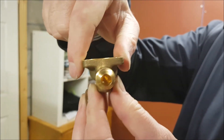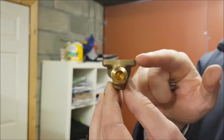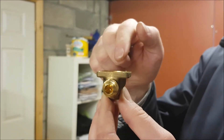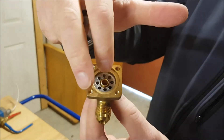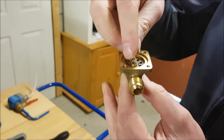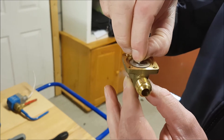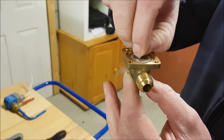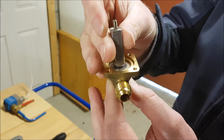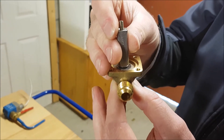If I turn it around this side, you will see the entrance. The natural flow is to force the refrigerant in an upward motion — the refrigerant has to rise up through this point here and then exit through this point. The diaphragm has to be lifted by the refrigerant in order to allow flow from the inlet to the outlet. If the armature is sitting on top of the diaphragm, the diaphragm isn't able to lift — therefore the refrigerant isn't able to flow.